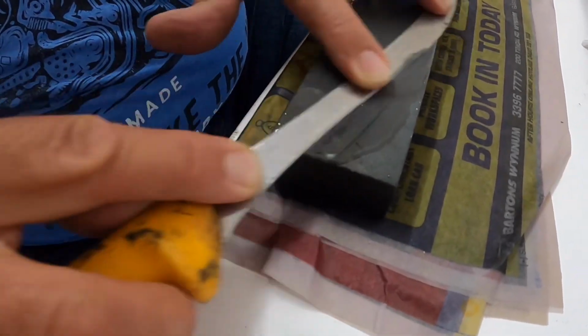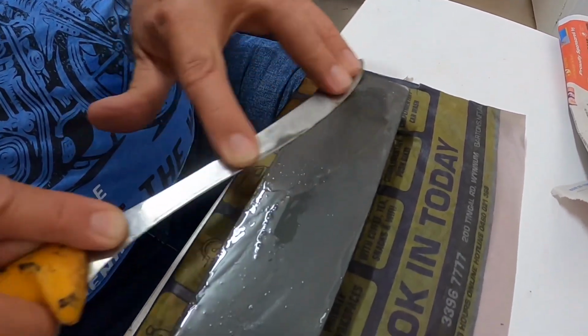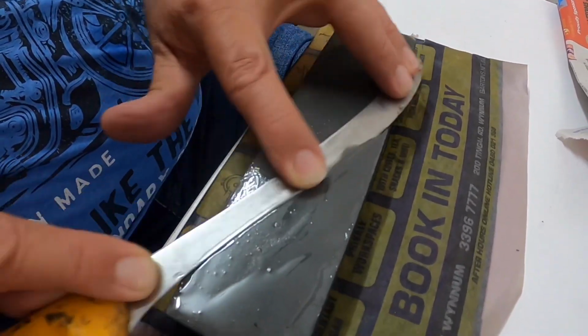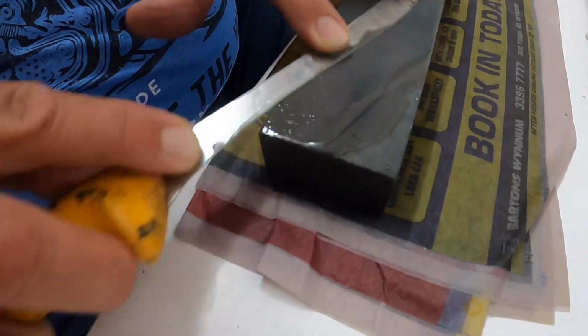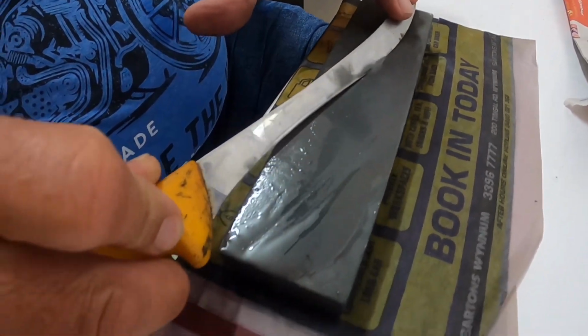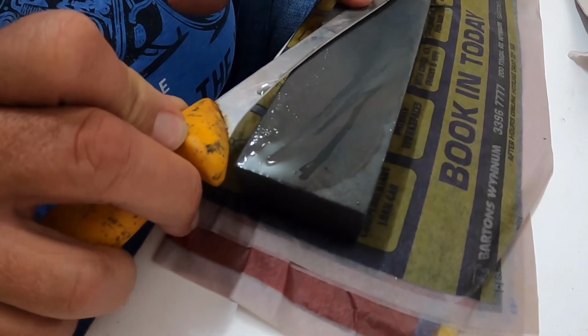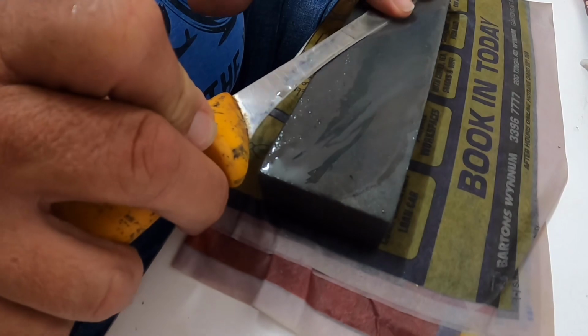Yeah. And I call it the blade singing to me. So when you get it in the right spot, you can just hear that hum, and it's just doing what it's supposed to do. If you go up too tight like that, that's where you get your poor man's edge, and you just don't get a good edge. And if you want it sharp at the back of it, you've got to have that. So that's why it's about the feel.